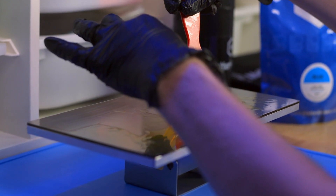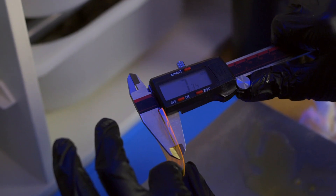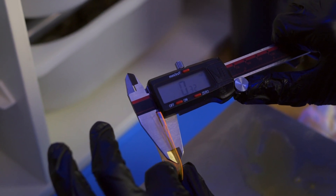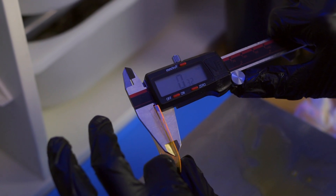If the part was well adhered to the platform, great! Remove it and measure the thickness with calipers. The difference between the thickness and 0.05mm, which is what the first layer height was set to, is essentially your Z offset. Once you successfully remove this calibration print, strong bed adhesion is great for printing, but you want to be able to remove the print when you're ready without damaging it. The Wham Bam flexible build system for resin is a perfect upgrade to make part removal trivial while still maintaining fast build adhesion throughout your 3D prints.